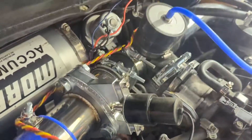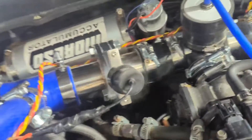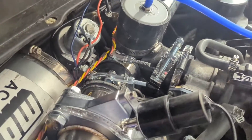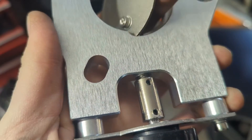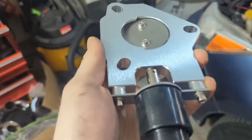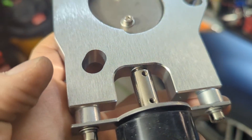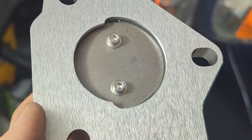The main culprit or suspect appears to be the location of the bypass valve. I assume because it's meant for use in exhaust or whatever, something here is not sealing properly. The bypass valve I'm using — most of the air is leaking through where the axle exits the body of the valve and approaches the motor. My goal is to shove an O-ring of the correct size right there, hopefully plugging some of the gaps leading in towards the valve.